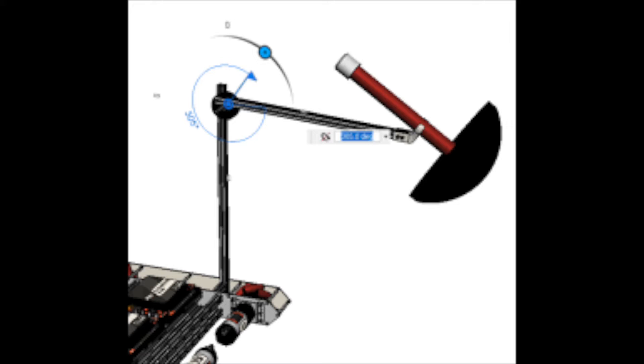First there's the single arm, which has a motor or servo rotating an arm. It has a very small range and you can only increase the reach by 15 to 18 inches because of robot size limitations. However, it's very simple to build and a great starting point for beginning teams.